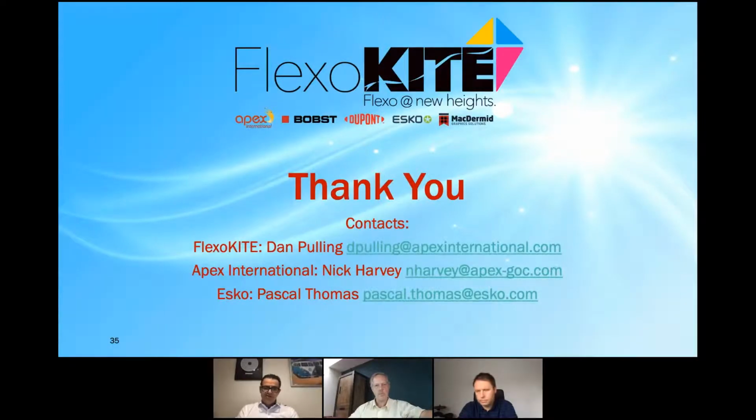When you look at choosing your anilox, and that's one thing that Apex does, that we put in place, is that there are many extreme specs on the market. If you wanted to drill or laser engrave a hole completely through the anilox, we can. Totally pointless, but you can. So we control or advise never to go too extreme or have too fine cell walls, because that then downstream creates less life for the anilox. It is an expensive part of tooling for the machine.